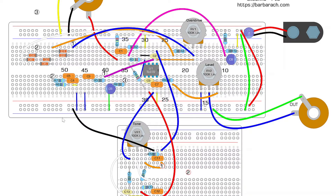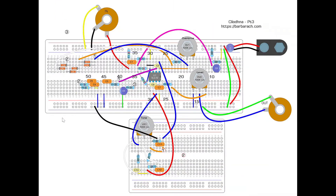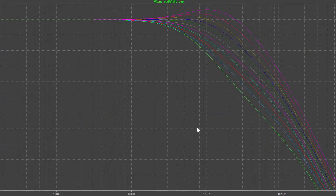I'm going to breadboard this. This looks terrible, like a rat's nest of all these wires. I moved this tone control to a separate small breadboard — you'll see that in the video. At this stage, I'm not using a switcher. As you can see, I'm just going to plug and unplug this wire here. Everything else is the same. I'll try out some sound later on during the demonstration. There's no point in me going through this — I just added this section here and rewired the output. It's getting a bit complex, isn't it? In terms of frequency response, the best is to hear the effect and see if you like it or not, rather than try to get too much out of these diagrams.